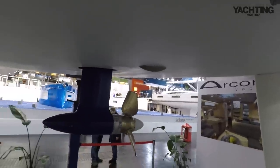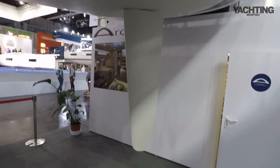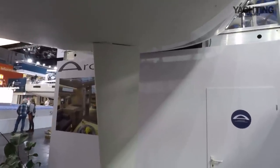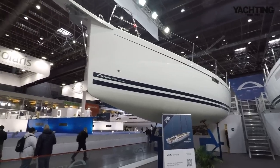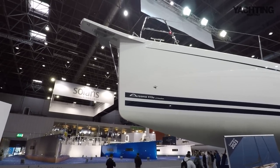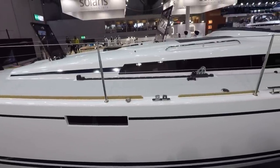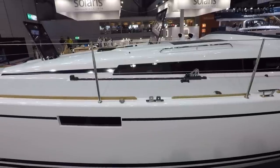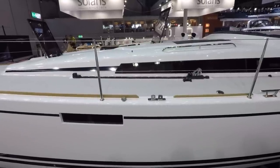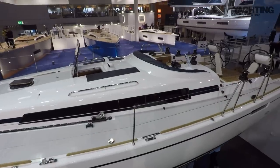Because the boat is relatively narrow on the waterline with a really fair run aft, she has a single deep rudder which gives you really good control for both manoeuvring and sailing with a minimum of drag and loads of grip. She's got the optional bowsprit — you don't have to have that, but for British sailors you'll probably have a bow roller there anyway, so it's quite a nice little thing to set off-wind sails from. These are the newer, larger hull windows updated in 2021 for the 415; they're a bit bigger and square now, still lined up with the sheer line to keep the aesthetics right. Larger coach roof windows, all perspex.